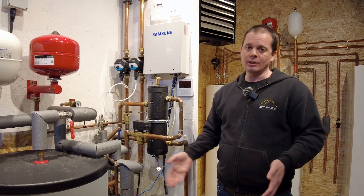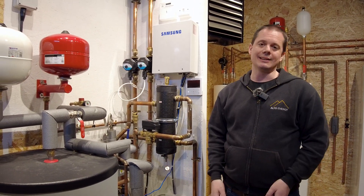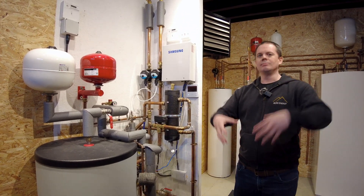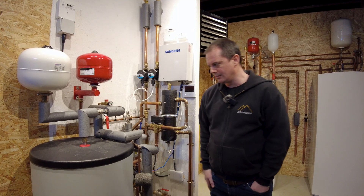You're not heating your house with that one degree of heat you've got from outside — that's just the catalyst to get the whole thing going. So that one degree boils off the refrigerant, compression turns it into high-grade heat, which is what then heats these.